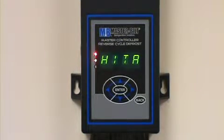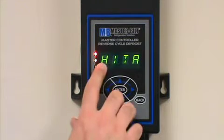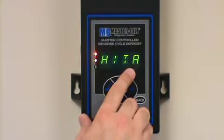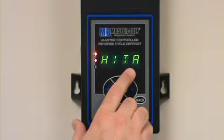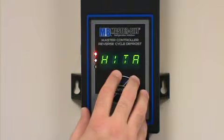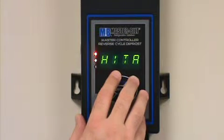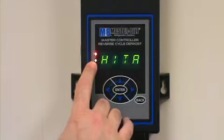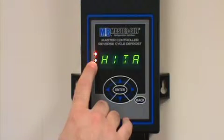As you can see, we have a couple of alarms in place on the controller currently. HITA is a high temperature alarm indicating that the room temperature has been above the room temperature set point by a specific offset for a specific amount of time. The controller defaults are built in as 10 degrees above set point for 60 minutes. That alarm is indicated by the amber LED that's also highlighted here.